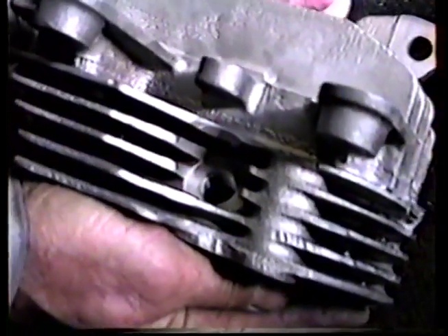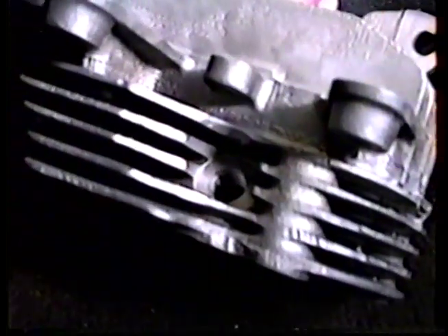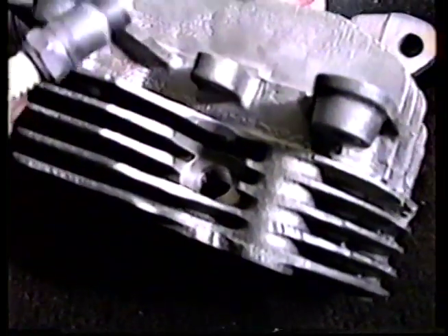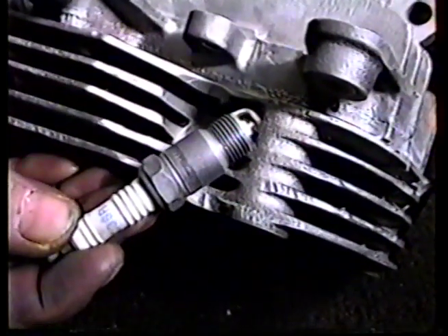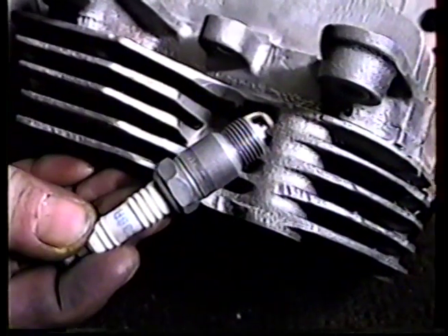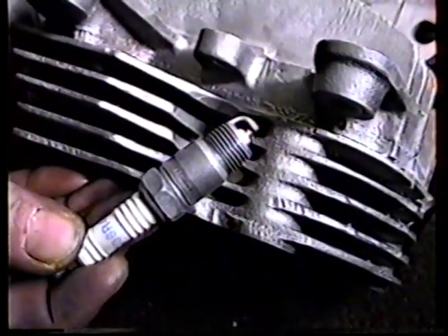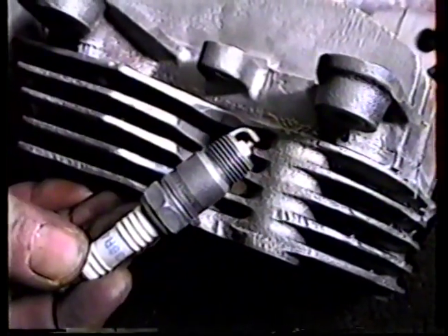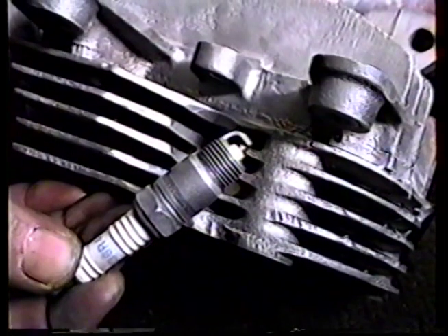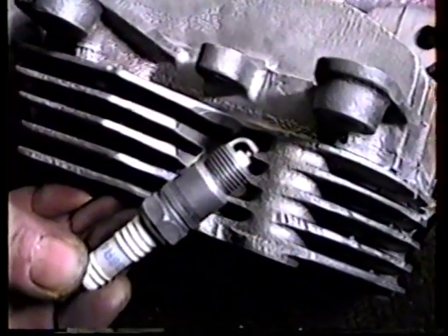We found that the clearance is so critical in here that you don't have more than 10 or 15 thousandths clearance. We use these little peanut spark plugs — late model automotive style. They're real small in diameter and that enables the guy to get in there with a socket and remove the spark plugs without having to remove the push rods. You do have to collapse the tubes to get the socket in there, but that's not a problem — in fact, it's quite simple to do.